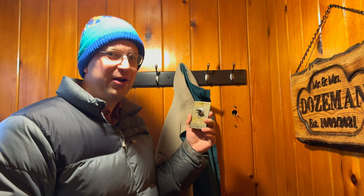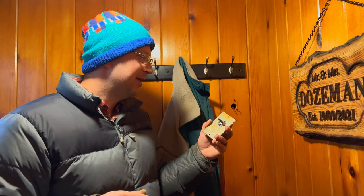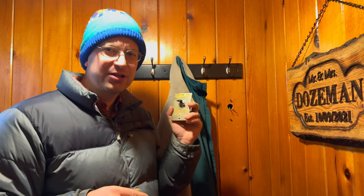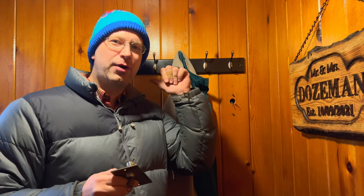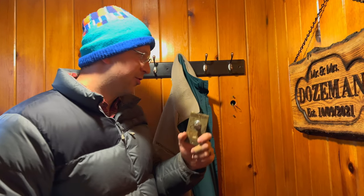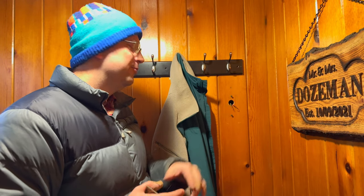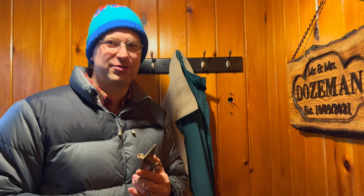I'm assuming at this point I'm going to have to do a little troubleshooting. The wire is probably broken somewhere. I don't know where, so we're going to see if we can locate that. The switch is working. I took the switch out to the garage door opener, hooked it up to the wire out there, turned it, and it opens and closes the door. So there's no continuity on this wire, and we've got to figure out why. Let's head outside and start there.